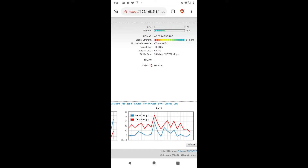So this is where I ended up. My signal strength is about 60 dB, which is pretty good. Horizontal and vertical alignment means the antenna is pretty well aligned with the other station. The noise floor is -95, so there's pretty low noise. The transmit CCQ shows 63.7 here but this is just a screenshot — it fluctuates between 60 and 75. Transmit and receive rate is showing 39 and 57 but that also fluctuates since it's on auto. So far so good, the internet's pretty stable. The real test will be later tonight when people jump on Netflix, YouTube, and Pornhub. Thanks for watching.